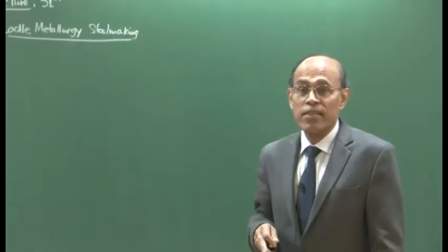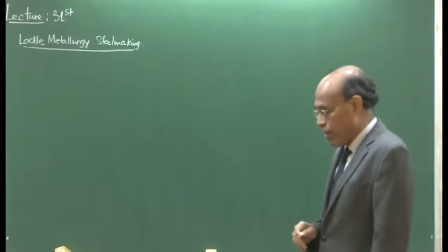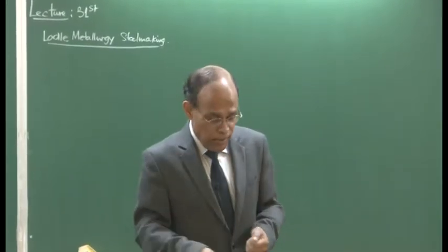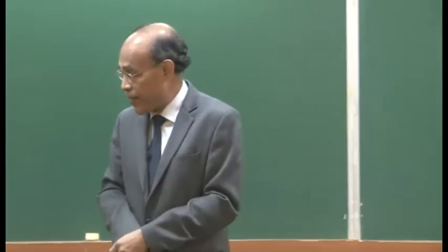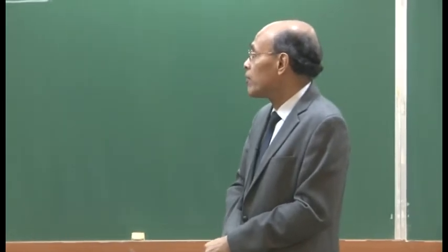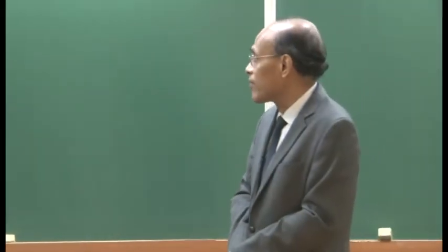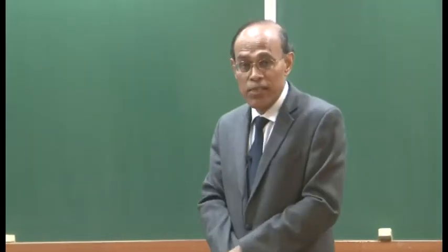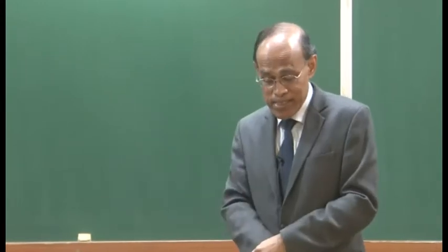So we are on to lecture 31 and discussing ladle metallurgy steel making. We have covered primary steel making, electric arc furnace steel making, the two routes of primary steel making, namely the oxygen steel making and electric steel making. And then we have also discussed stainless steel making in electric arc furnace. We finished discussing deoxidation of steel, deoxidation thermodynamics and kinetics, and we are on to ladle metallurgy steel making.